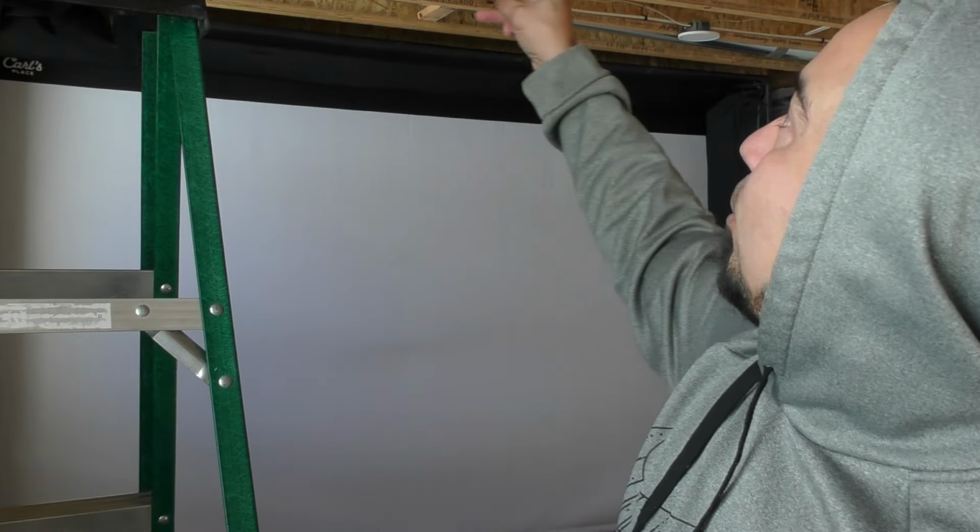Gotta catch my breath. Right here, thank you for choosing Protee United. That's what we got here in the basement, the Protee VX launch monitor, ceiling mounted. I need 9 foot minimum. As you can see, I got open joists. I wanted to make sure the camera was good. God, my forehead is massive. Anyways, I got open joists, so I'm gonna recess it into the joist just a little bit to get that full 9 foot. This is a cool little thing they sent me, right?